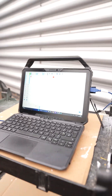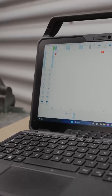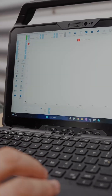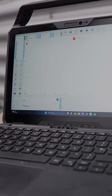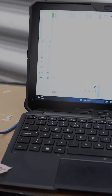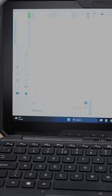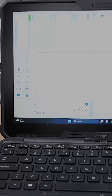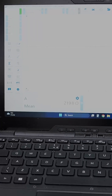We have got the scope up and running with the settings at 20 milliseconds per division, so it is in block mode, and we have a measurement set to large. They've just given us the average, so as soon as I connect the PP circuit to the PE using the resistance lead, we can see we have 220 ohms. So I think that's fairly satisfactory — this would imply that everything is good. We're going to connect the vehicle and it will charge up, which this charger does. So this charger doesn't have a problem.